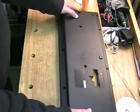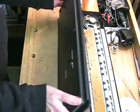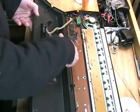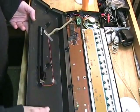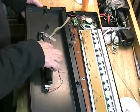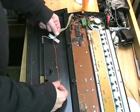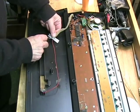To open the case, we lift it up very carefully because there is wiring connected underneath. We can see the keyboard, the control strip, and the battery section. The next step is to free the wiring for the battery — the wiring is held to the bottom of the case with strapping tape, and as soon as the tape is loosened the spring for the battery comes right out.